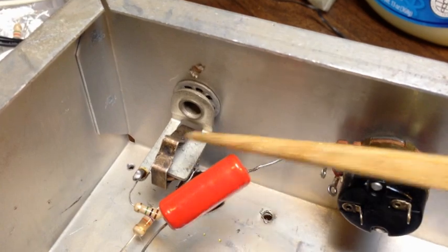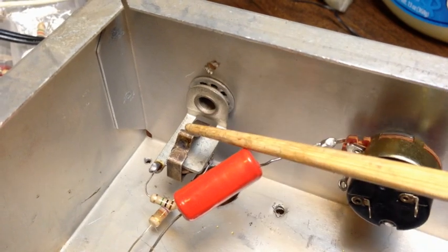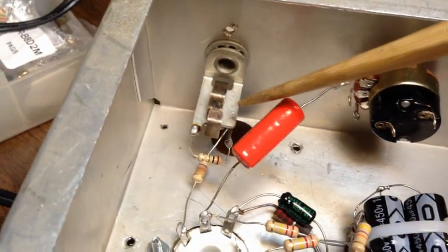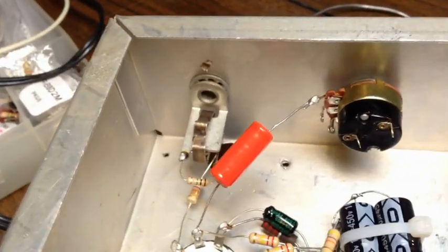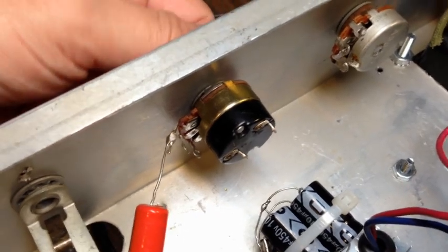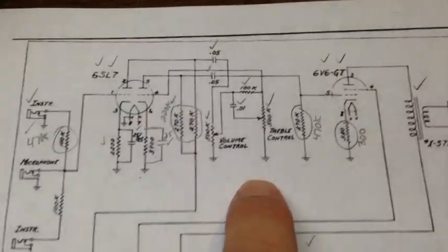Look at this thing — it's weird. It's just like a plate, and it's actually a grounded jack. When you plug in, it pushes this down and ungrounds it. What a weird design. You have two terminals down here underneath, and this plate serves as a ground terminal. Very cool jack — I just had to use that. I found a couple of those in my stash. We've also got a switch on the volume pot — a 500k — and this volume pot is a 1 meg.